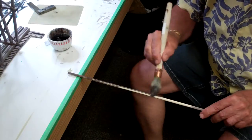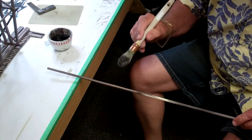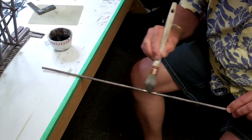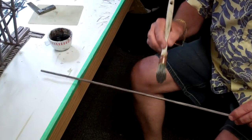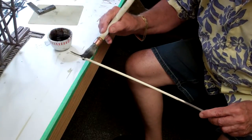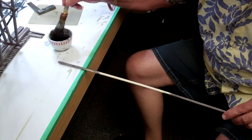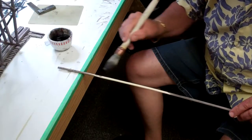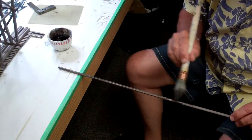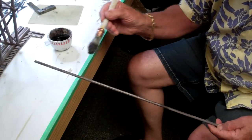You can use a rag as well if you like. Just keep in mind to wear rubber gloves if you're going to be using a rag or anything that carries the stain onto your fingers, because it is carcinogenic. We don't want any stain on our hands. It's just a nice fast method — nothing complicated about it. The stain settles into all the grooves that we carved and puts enough texture in there to make it interesting.